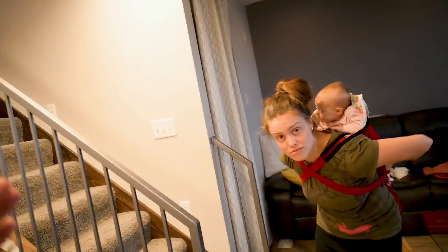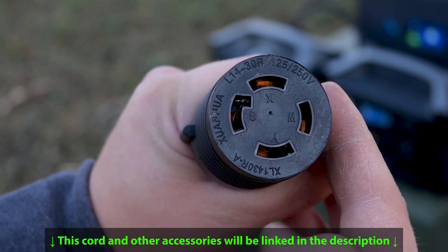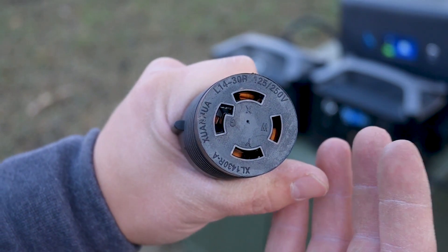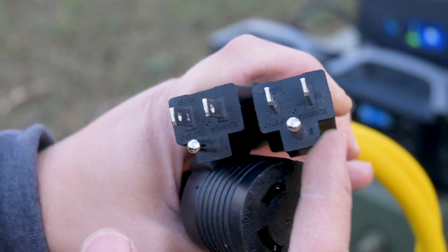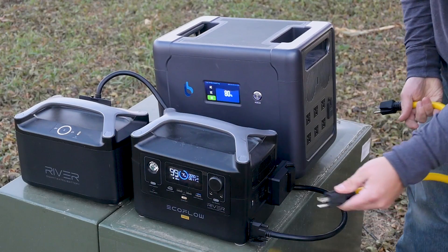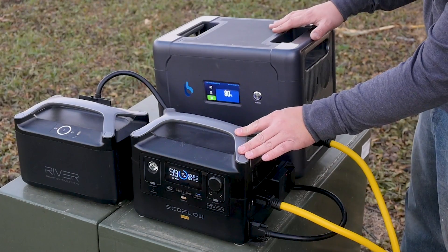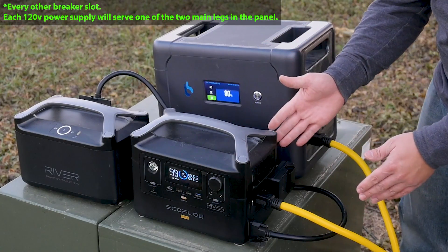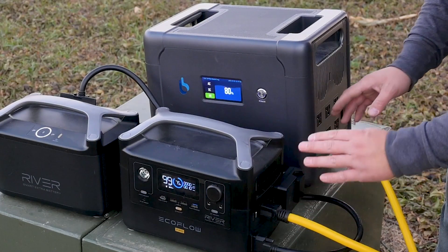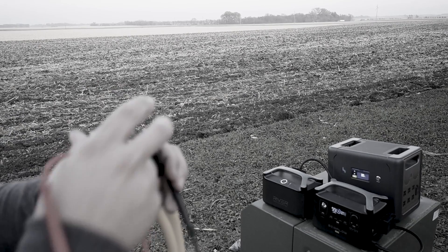So the power is going to go off, and then it's going to come back on, and everything's going to be fine. What we have here is a NEMA L14-30R receptacle. This is what you would see on most 30-amp generator cords that would attach into the inlet box at any property, but instead of having another 30-amp plug, we have two standard 120-volt plugs. So what I'm hoping to be able to do is take these two plugs, connect them to our two power banks, and in theory we'd have the combined capacity of these two to serve the property. I do want to use my electrical meter and just test these plugs. We're going to throw our electrical tester into continuity mode.